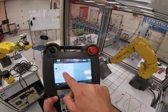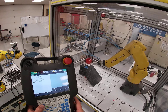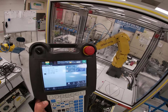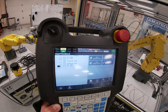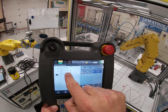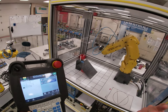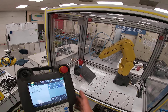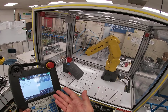I added another intermediate point for exit, so I have the robot come here first and then go to a perch position. Don't look at the numbers in the lab because you'll get DCS faults based on speed. Look at the numbers I have here: I'd like you to go 30% on joint movements and 200 millimeters per second on the circular motion.